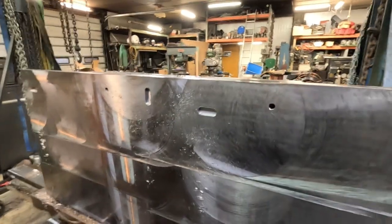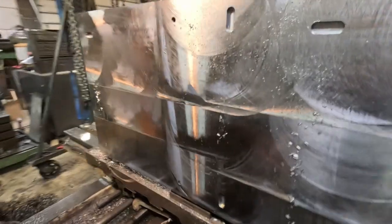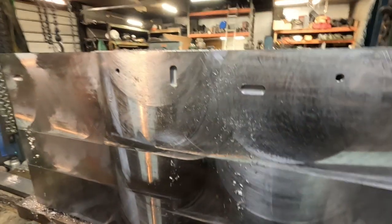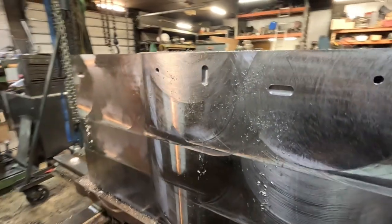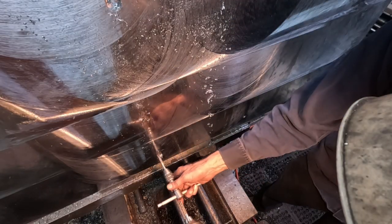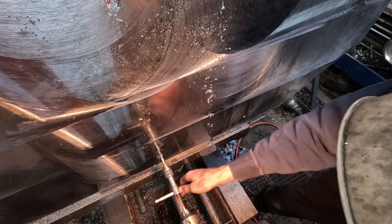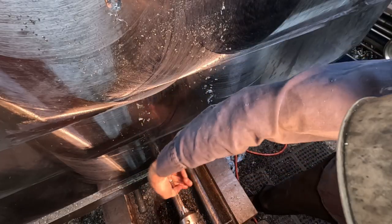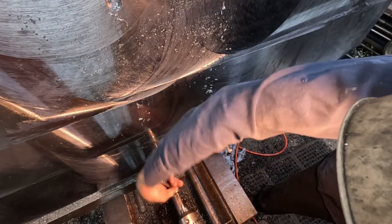Good morning - I cashed it in last night, was having trouble doing the math, it'd been a long day. I've been at it again this morning. I had two key slots in when I quit last night, and this morning I've put in that one and that one. The idea is that I can pull this plate and index it either direction on my table. I've been hand tapping these with the assistance of a guide, simply because the only other safe way would be rigid tapping - but these are blind holes, and there's no way I'm running blind holes rigid tapping on 5/16ths with a machine this size. That's guaranteed broken taps.